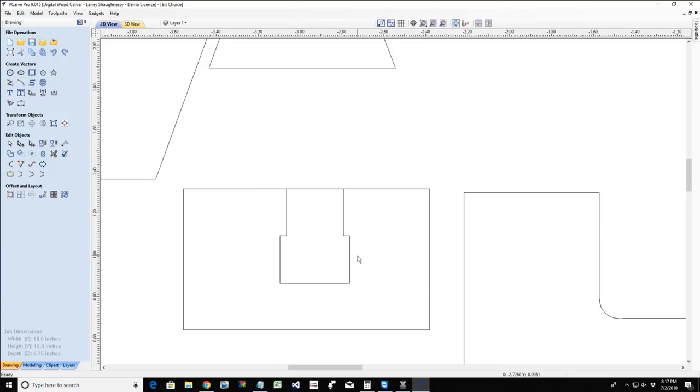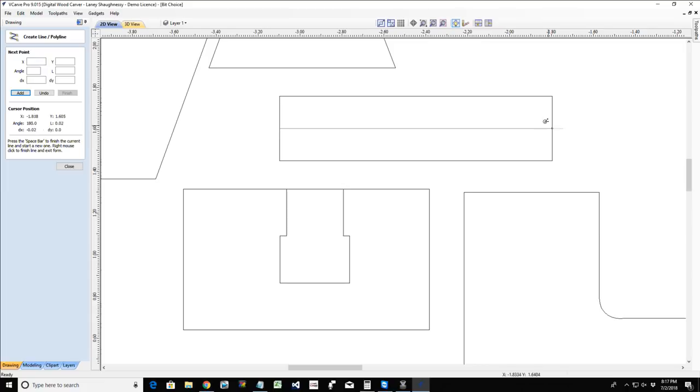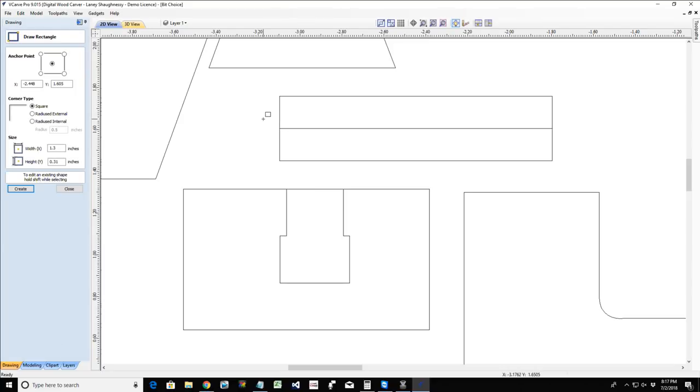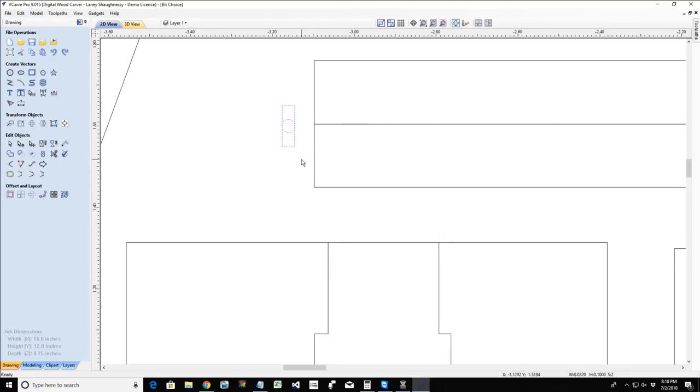Okay? And for this cut, if we were looking at it from straight on, from the top down, let's say that this was my board, I literally am running a straight line with my bit, and as my bit comes, this is from looking straight down, so let's draw the shank in here. Come on, you can do it. There we go. Okay, so if we were looking from the top down, my bit is literally following a profile cut, cutting that line, right? Profile cut on the line.